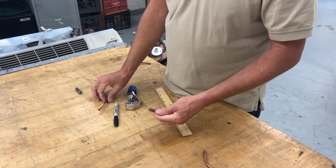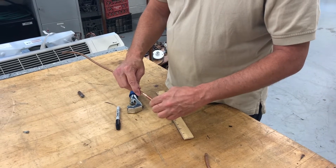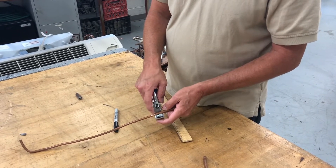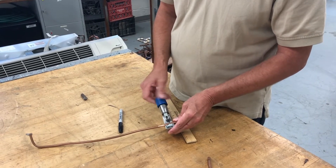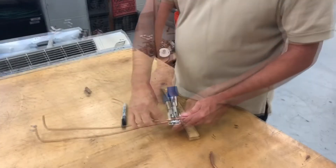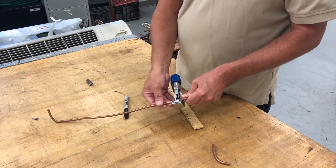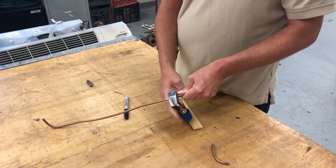Now we're ready to constrict. I'm going to put it in about an inch — I'm about a half inch over but that's good. I'll place the constrictor so it lines up evenly on the edge of the pipe and apply a small amount of pressure. I might have to reset it because it's moving around. Once I get my pipe where I want it, making sure we have our angles, I'm going to roll it around like we're cutting a couple of times. If it needs to be pushed in or adjusted, we can do that before we tighten and roll around again.